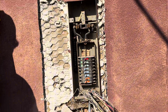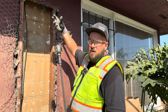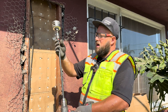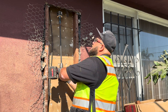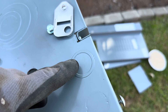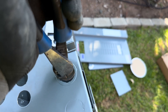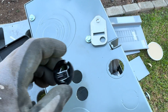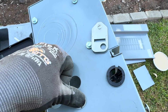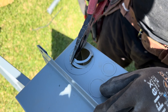Make sure you open up past the stud just a little bit on each side so the new panel can go right up in there. Once the old panel is out, we drill a hole through the roof using a hole saw sized for two-inch rigid conduit with a long extension. To get wires into the panel, we knock out the pre-cut knockouts using dykes or needle-nose pliers. Then we snap in the half-inch snap-in bushings. Finally, knock out all the way to the two-inch knockout for the riser.